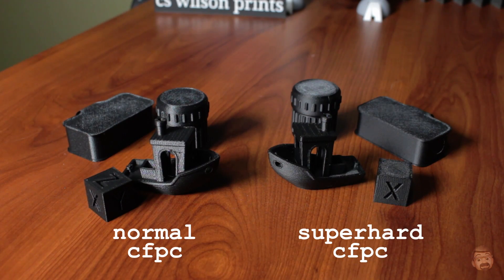I've been printing with these filaments for the better part of the last couple of days, and here's what I found out. For both filaments, I did have to bump the nozzle temperature up a little bit because of the new nozzle. Pryline recommends 250 to 270°C for the new super hard polycarbonate, and 250 to 260°C for the regular polycarbonate. They also recommend a bed temperature between 80 and 110°C for both varieties. I used 260°C for the nozzle and 90°C for the bed, but I probably could have knocked the bed down to around 85°C. I printed a small sampling of benchmarks and some parts that needed close tolerances. On the left are the parts printed with the normal polycarbonate, and on the right are the parts printed with the new super hard polycarbonate.